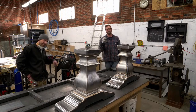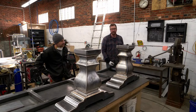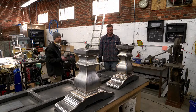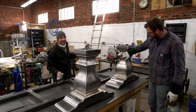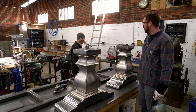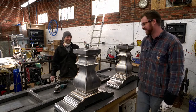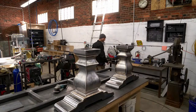Steve welded these with silicon bronze and the TIG. That's all this gold color here. Silicon bronze melts at a much lower temperature, so he was not at risk of burning through the steel plate. And of course he had to show off a little bit and stack dimes, because this isn't getting ground down, it's getting painted over, so the end result needed to be nice. It's not quite nuclear pipe. Steve was a welder in the Navy for 8 years. So he had people breathing down his neck for a long time, and now it's freedom. No inspector. That's right. Well, I'm going to let him get back to it, and I'm going to get back to my super interesting project over here.